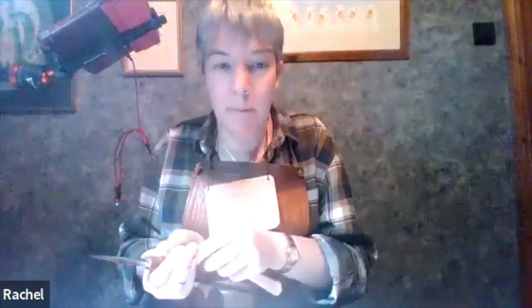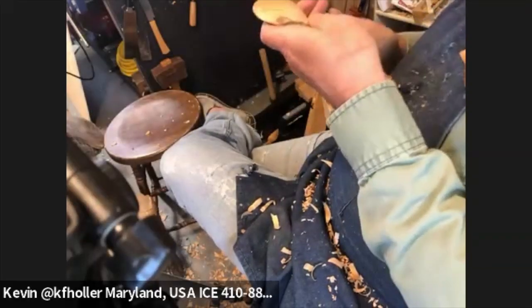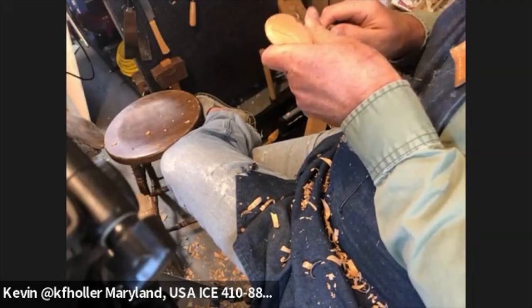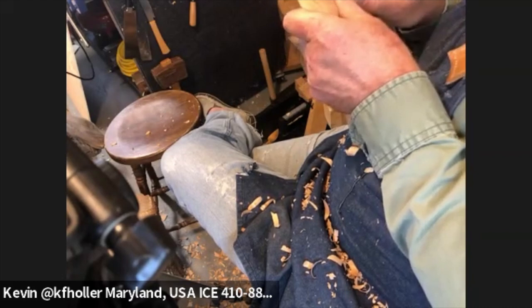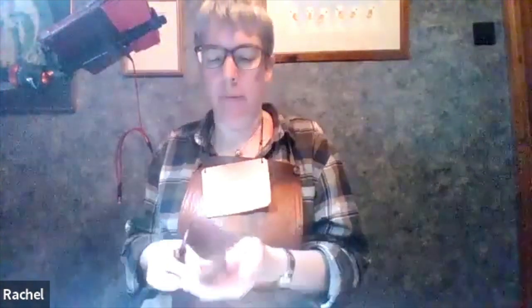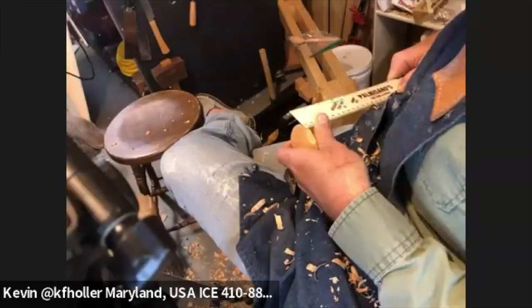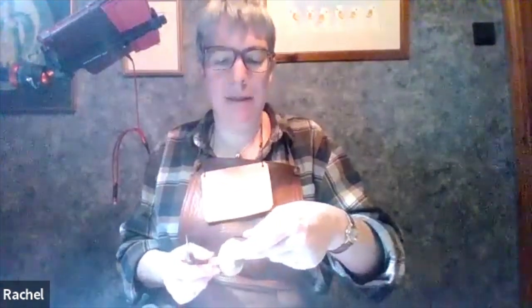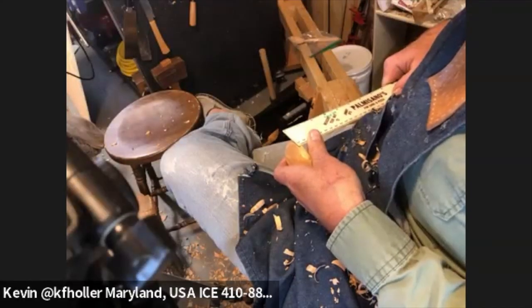So in my mind, the front of the bowl there is just about finished now. All right, I think I've got my rim from about the grain change. It kind of dives down to the rim, and then the rim kind of stays consistent all the way around. Good. And it is pretty much 2 mil, maybe a little less than 2 mil. Mine's probably nearer 1.5 mil.